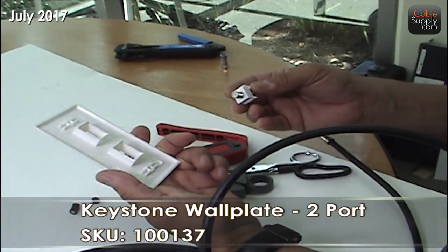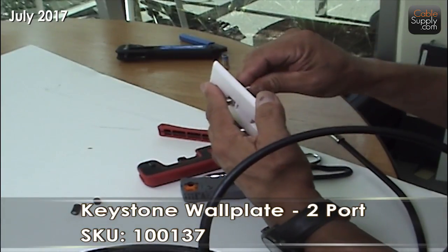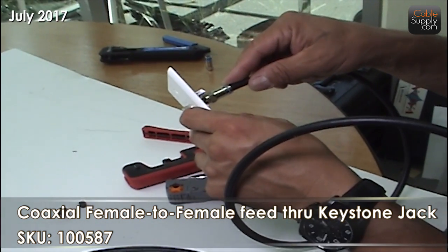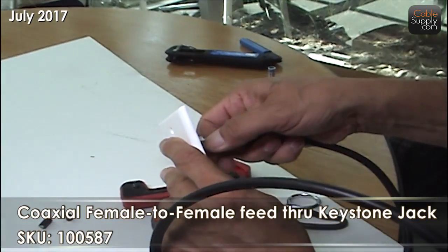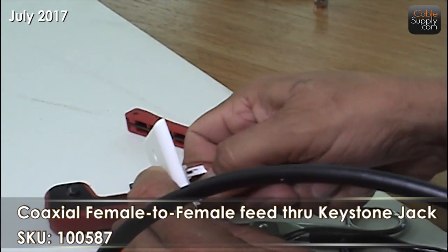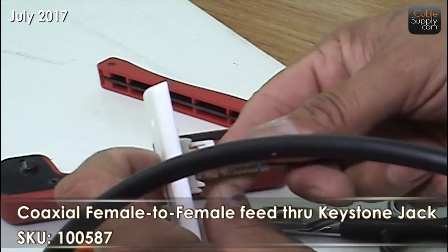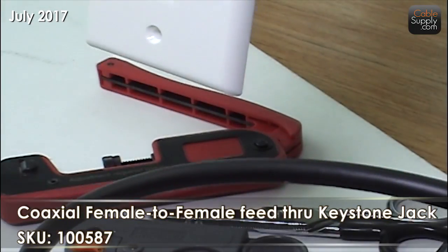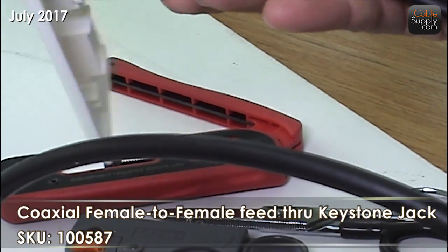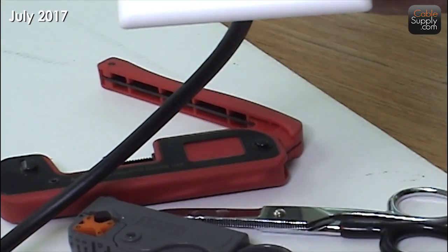So you see you have that little connector there — it kind of looks nice. Then what you do is on the other side, you put the cable in there. You know when it screws in when it has threads — it's called an F connector. And the thing it's screwing into, to give you a really nice appearance on the wall, that's called a keystone F connector. That goes into a keystone plate. On this plate right here, you just put a blank there, or you put your telephone there. I have these in my house — they really look nice, rather than having the cable just hanging out of a hole in the wall.